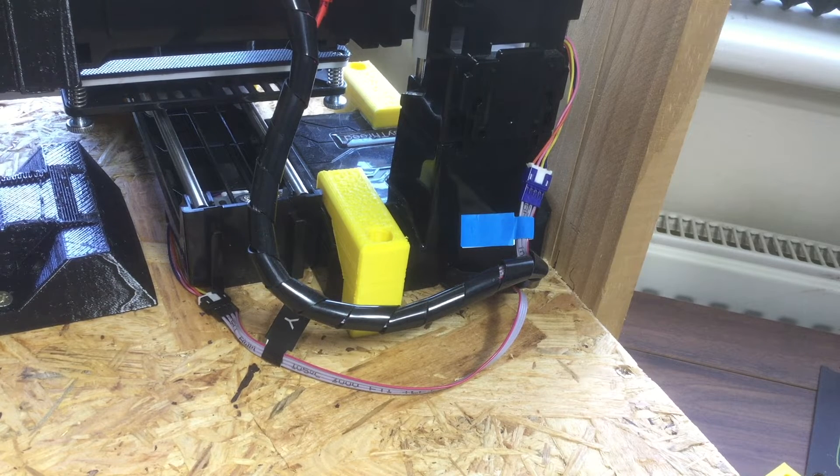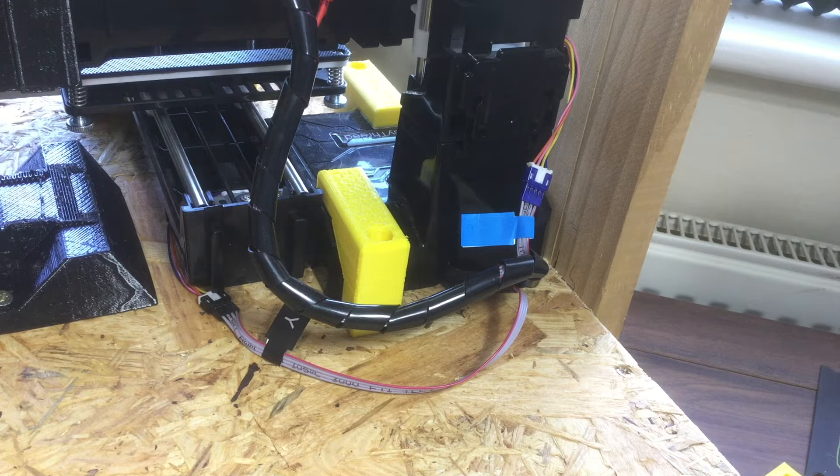I had intended to just fix the base to stop it moving just for the sake of convenience, but then I thought it might be a good idea also to steady the printer using it, and it's turned out to be so, because the print quality's gone up in leaps and bounds since I first started doing this, and the printer's a lot stiffer now. The STLs will be available, and also my original design files from DesignSpark Mechanical.